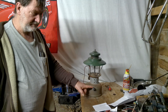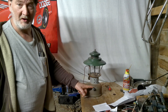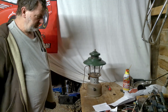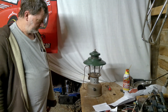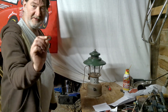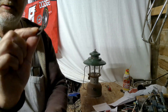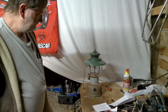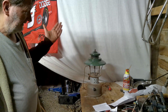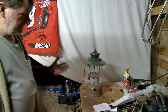The only thing I will do is get a different pump cap — this one doesn't have a hole in it to add the oil. I've got a couple of extras, or I may see about getting one that has that, or maybe drilling a small hole in it, because you don't want to keep taking that thing off to put oil down in there. So far the only thing I've had to replace was the pump cup itself — it totally cracked. That's not usable. I had an extra one laying around. So there's a Coleman 228 lantern from, looks like, September 1957 — operational.